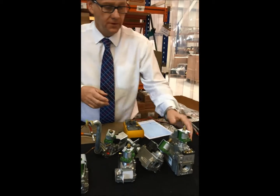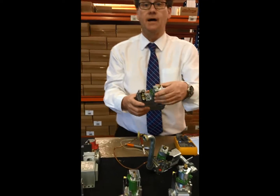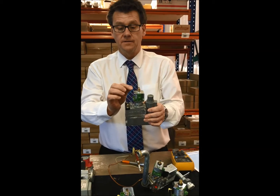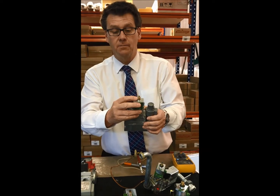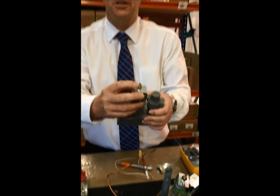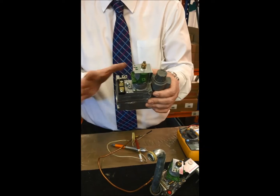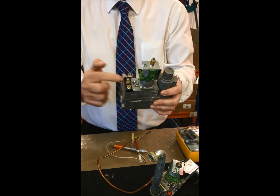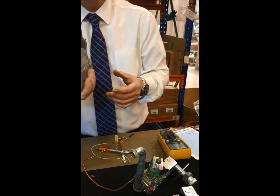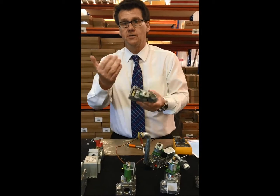Moving back in time, this was off the standing pilot light boiler. This was the old single solenoid valve where on the modulator we have a brass and a plastic nut. The brass nut was the low burner pressure and the plastic nut was the high. The thermocouple connected here is about 18 millivolts when testing. Single solenoid with about 3K across there on the gas valve. Not used - just fixed solenoid, step modulating up and down.